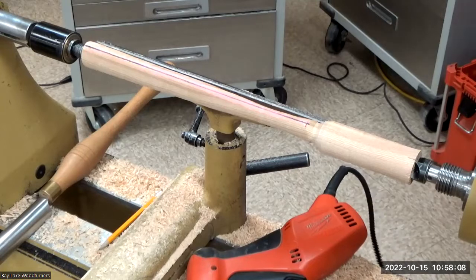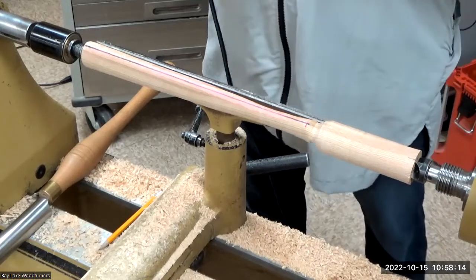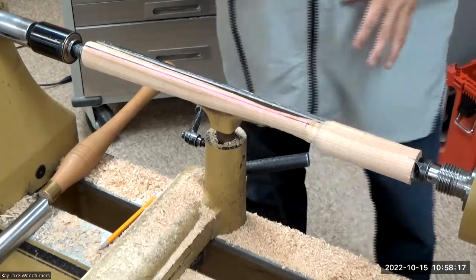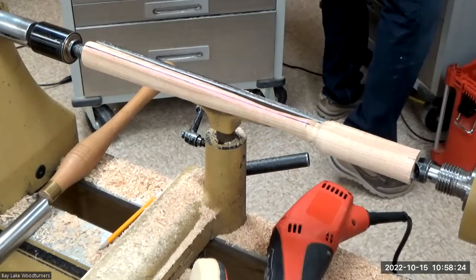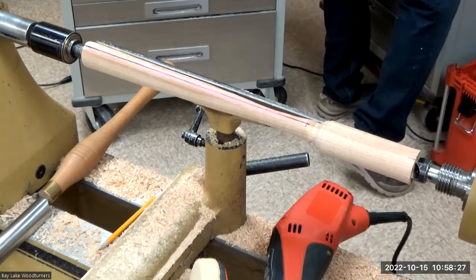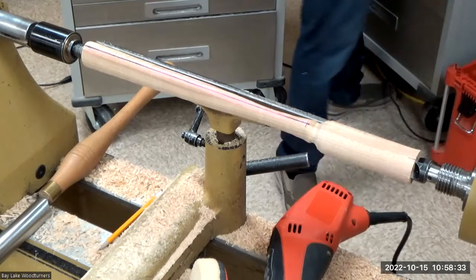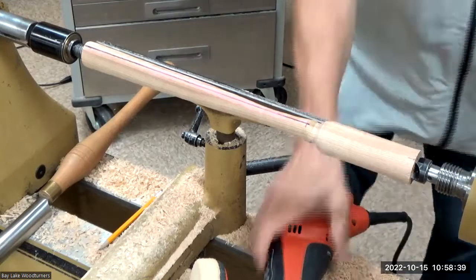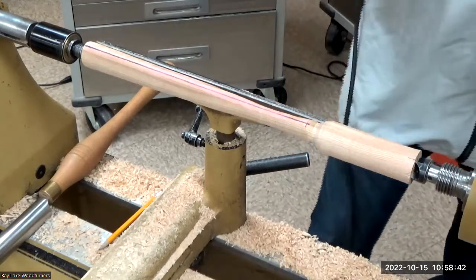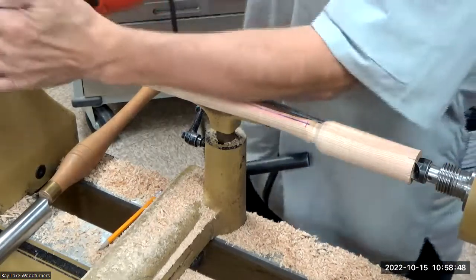If you have a long straight line, then you want a large flat surface to sand it, so that you can get that smooth surface the way you want it. If you have a curved surface, then what you want to do is find a way to get something of a similar arc, a similar curve, and use that to get the final shape. So this is actually one of my favorite sanding tools.